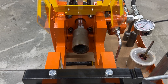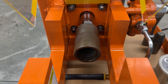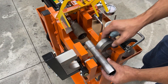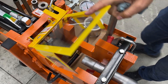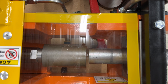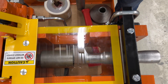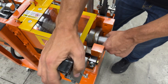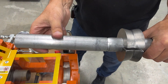Now for reducing the OD of a tube to fit inside another tube, we're using the swage box with this reducing tool. As you can see it's just the reverse of the expanding tool. This will also use the collet to clamp the tube in. Now we'll run the die over the top of the tube, and as you can see we've got a reduced tube that fits inside of itself.